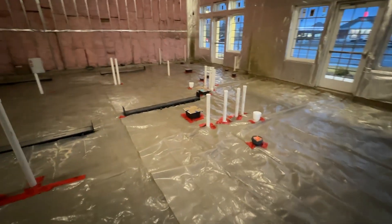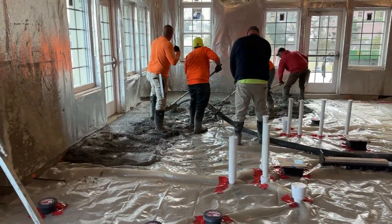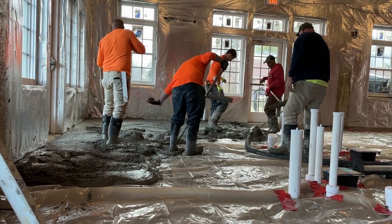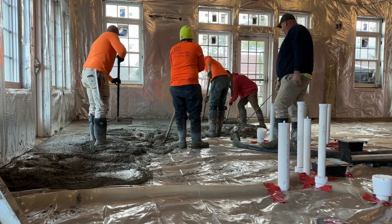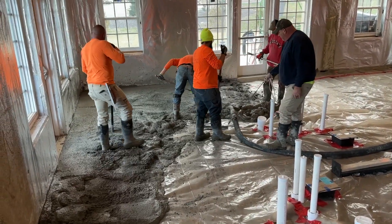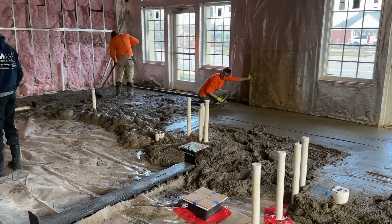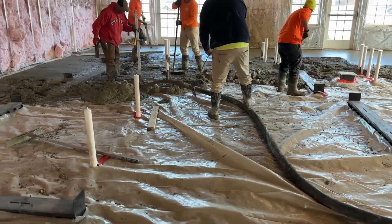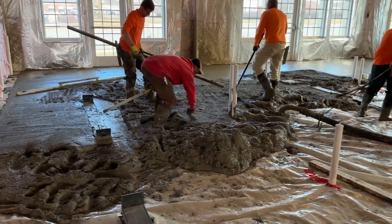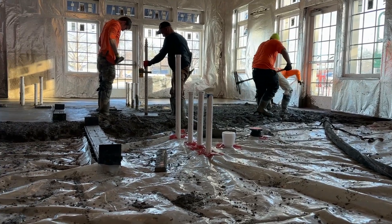The next step will be to pour the concrete. The next day we come out with the concrete crew. They have a pump truck and this will use about three trucks of concrete. The concrete truck will unload the concrete into the pump truck, and the pump truck will pump the concrete in — the man in black is controlling the pump hose. We have four other guys moving the concrete, and as they move it they'll start leveling it. They'll use two-by-fours or leveling rods to level it, and they'll shoot it with a laser to make sure it's level at the correct finish floor height. As they progress, they'll keep matching the existing level and shooting it with a laser to make sure the height of the floor is consistent through the whole building.